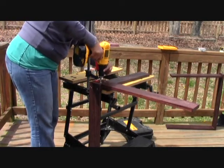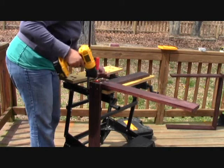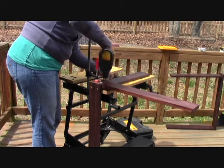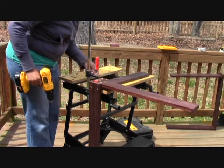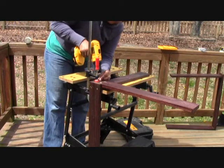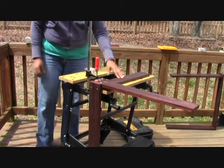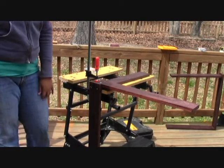I'm going to make my 4th hole, but the clamp is in. And for these, instead of the 2-inch ones, I'm using 1 1/4. And this is the exact reason, this bar right here is the reason why we had the overhang in the back. So this is my back leg. Alright, so I'm going to keep on doing that. I'm going to do it with the other leg as well, and I'll have part of my frame finished.